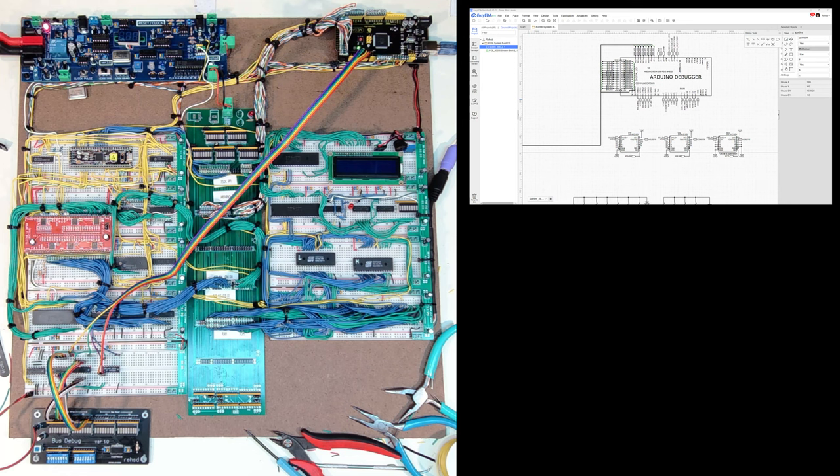I'm starting to work on that, and what you're seeing here are really the three ICs I've added to my system. Down here I've added a breadboard, and on that breadboard I added a NAND gate in a previous video. Now I've added three of the 74165 — for now I'm just using a pair of LS's and one actual 74165. I'm going to use the first two to grab the high data byte and the low data byte from the data bus.